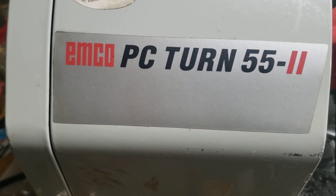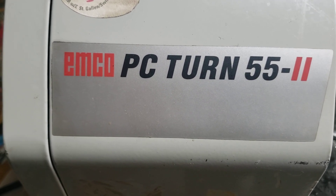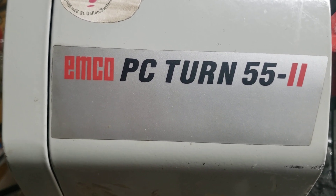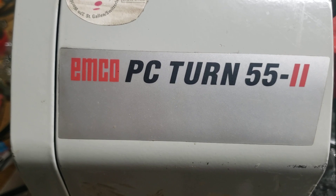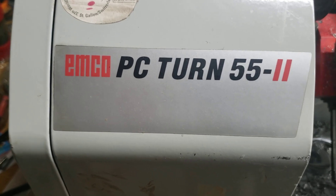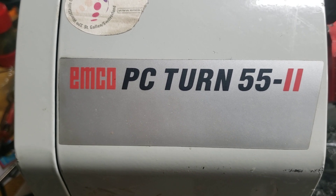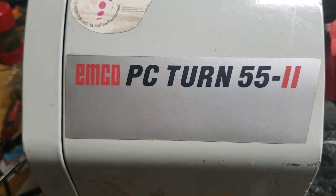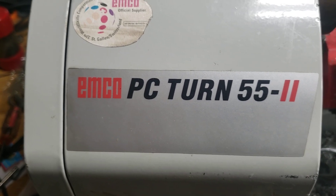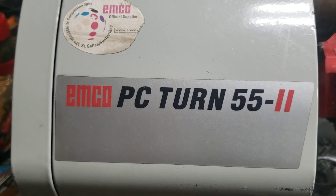But that gave me the incentive to revisit a couple of things that weren't working quite well. And the same day, I managed to get what I was working on working, which was the G76 threading. I couldn't get it to synchronize with the machine — I couldn't get the threading cycles to work. So after a quick consultation with Google, I found information that led me to reversing the encoder scale going into the MESA card. And after that, everything worked perfectly. I've been tearing my hair out for no reason whatsoever.